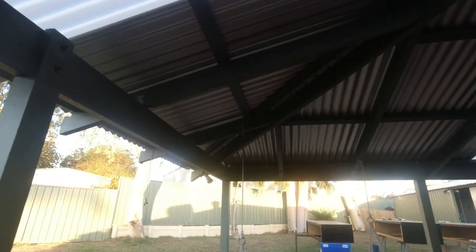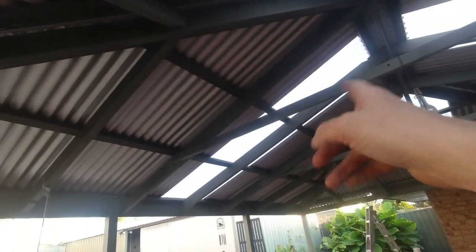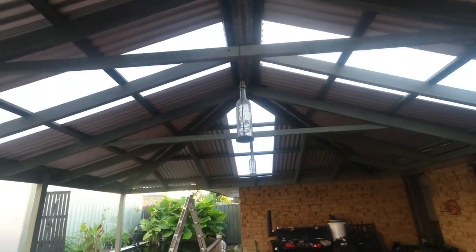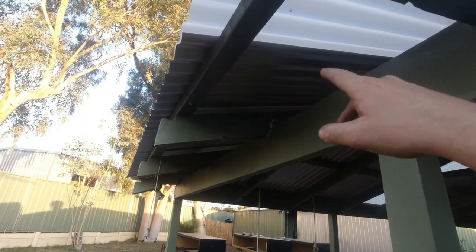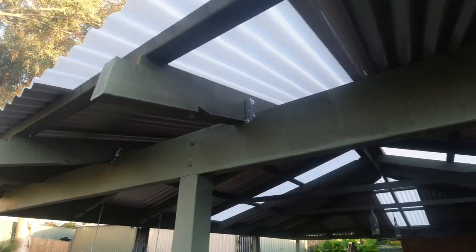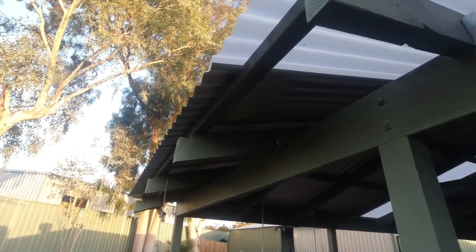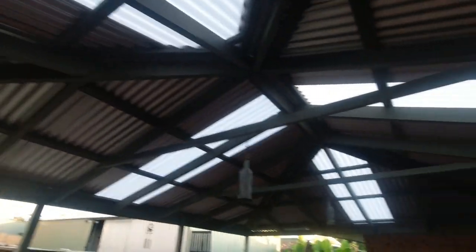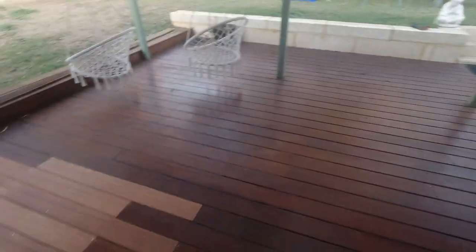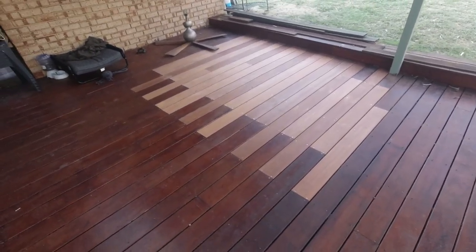One more positive before we go into the negative - the roof has been re-sheeted. It's not all clear anymore, it's zinc with an opal something finish, so the sheeting is better than before. They've also added triple grips. I'm not sure why they used tech screws - I would have gone with a panhead screw or nailed, but once it's painted green you won't see them. Paint is coming Monday, but not before they fix the decking. Can anybody spot the problem with the decking? Pause the video and drop a comment.